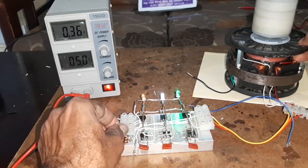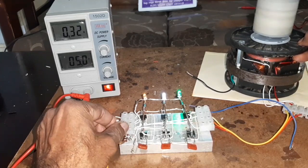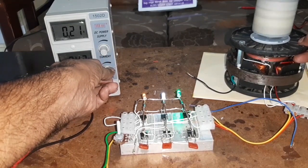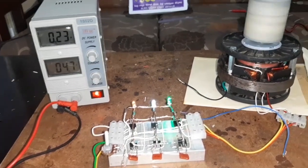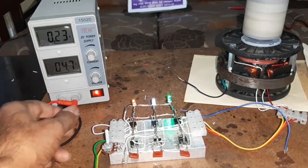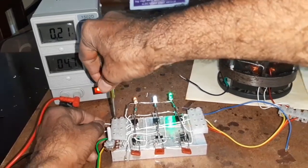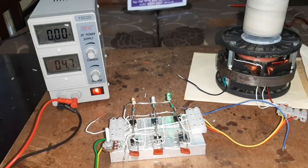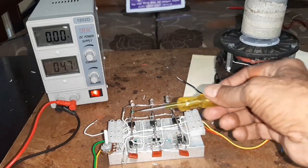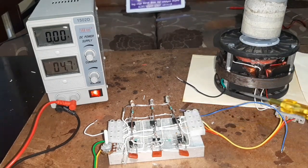I am using a small barrier to increase the speed. Now I am going to remove the loop - what happens? The motor is going to stop. Because the half-bridge is disconnected - the top side 3 MOSFETs are disconnected. That is why the motor is not running with the 3-wire system.